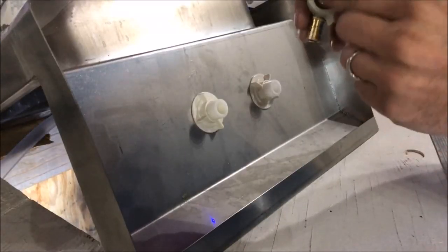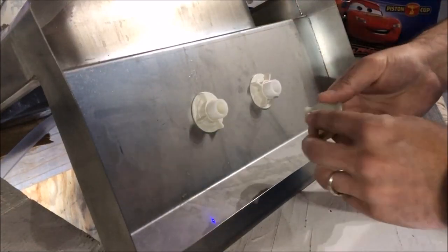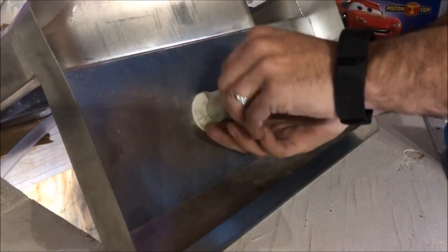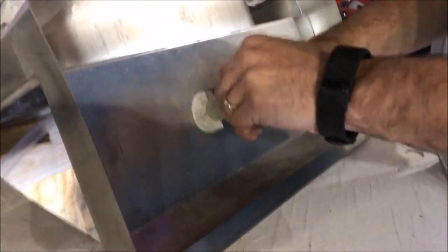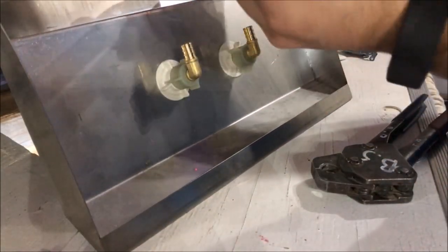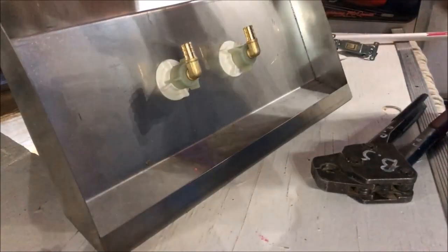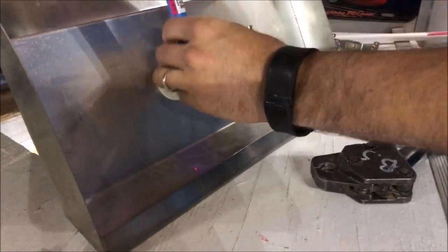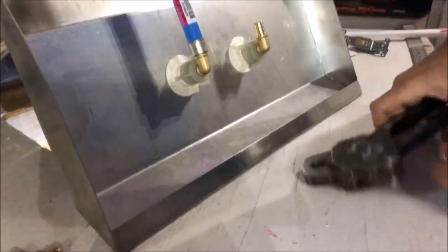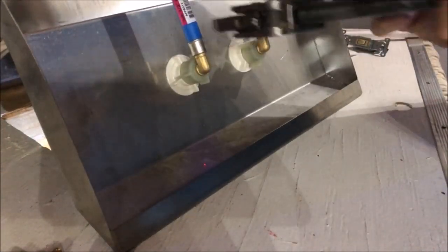This has a little rubber gasket which seals up against the inside, so that's how we're going to put it on here, and then we will put the PEX into the end of that. For the next part I'm using the kind that has this little silver cap — make sure you're nice and straight on the end. Put that over and put that on this side so that pops down right over, and then you take your crimp tool and open it up.